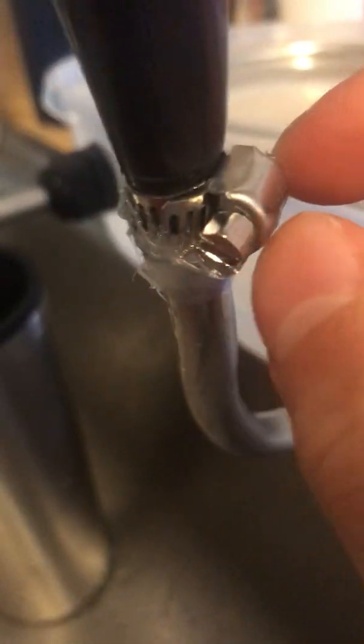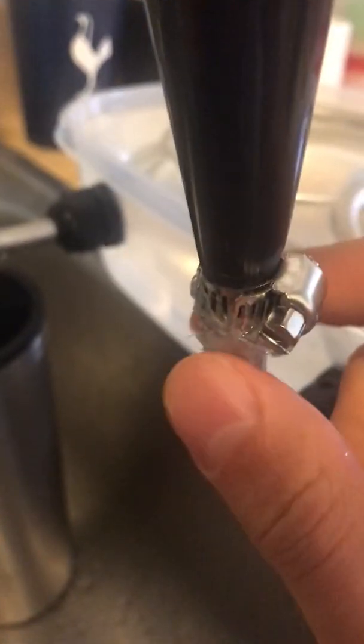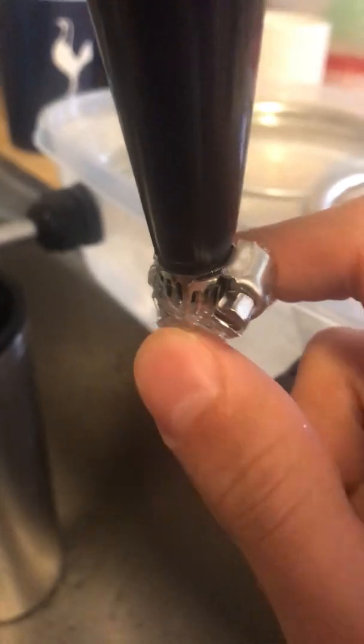I did drill some holes in here that ended up not working too well. It cracked here. Another difficulty I had was finding a way to seal this. So what I ended up using was a hose clamp, and then I put the sealant around it after I tightened it all the way. That actually worked out pretty good, but I wasn't having much luck with anything else.